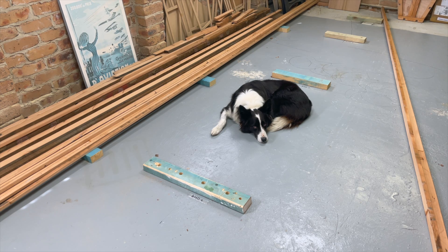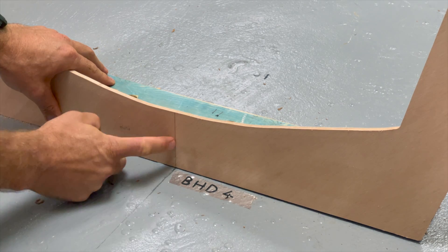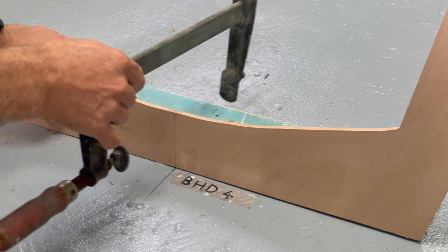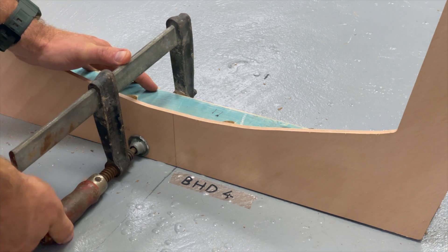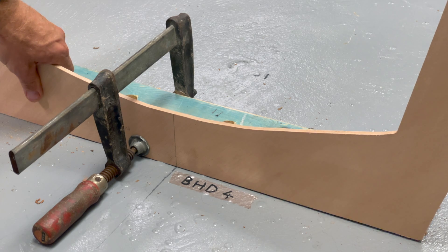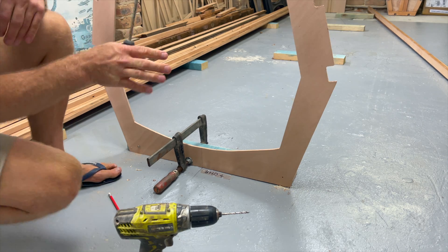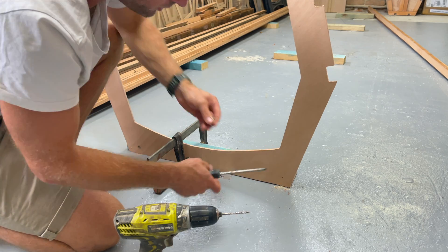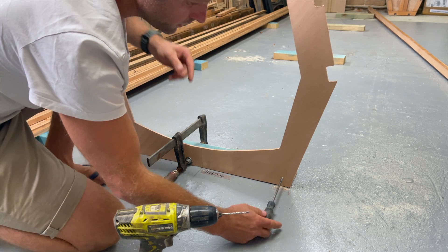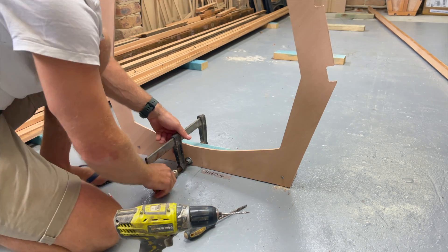And Max stays exactly where we need to go. Thanks for looking, Richard. So, bulkhead 4 — you can see our centerline on the bulkhead, and you can see the centerline on the concrete. I'm going to put a clamp on this to hold it in position whilst I get my screws in. I've left a little bit of the screw out because I may need to adjust this vertically. Once I've got these in, I'll put my spirit level on this and make sure that it's plumb up and down.